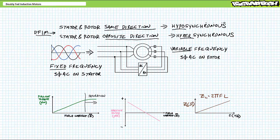Lastly, we learned that starting synchronous motors, necessitating synchronization between the stator and rotor magnetic field, isn't as easy as one might initially suspect, principally because upon the closure of a full voltage starter, the stator rotating magnetic field is instantaneously established at full speed, whereas the rotor and applied load with some level of static inertia may take some time to come up to this speed. For this reason, one might need to resort to some cunning trickery to either speed up the rotor or slow down the stator.